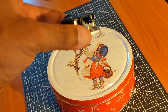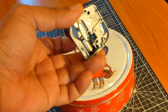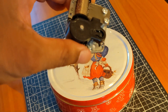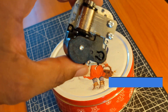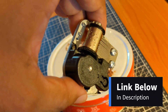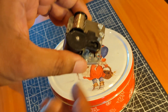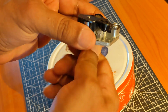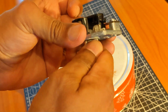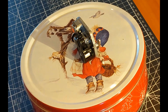Our inspiration behind the all-mechanical tracker was actually this old-timey music box. I'm told that these devices were quite popular maybe a century ago, so before Walkmans and iPods. There's a great video about the mechanics of these devices by Bill Hammack from University of Illinois — I'll put a link in the description. In short, these devices employ a clock spring to store mechanical energy. The release of stored energy is modulated by a combination of a gear train and a damper, and the pins on the rotating drum and a metal comb create the sound.